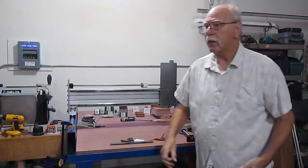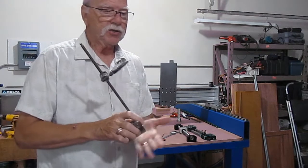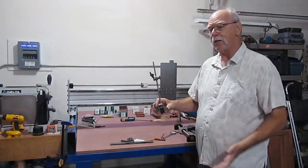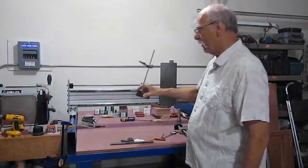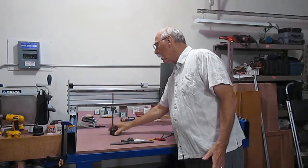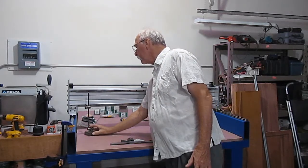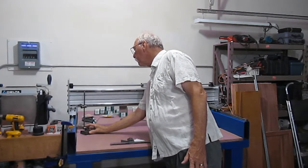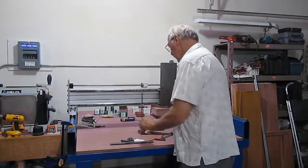And what I would like to just illustrate briefly, just how close you can get with that simple measurement. And I will come over here and get my, now this is the only precision tool that you'll see me use or introduce, and I'm not using it, I'm just using it for illustration purposes. But it's a dial indicator, and I can come over here and I'm reading minus 5 thousandths there. Let's zero it out.